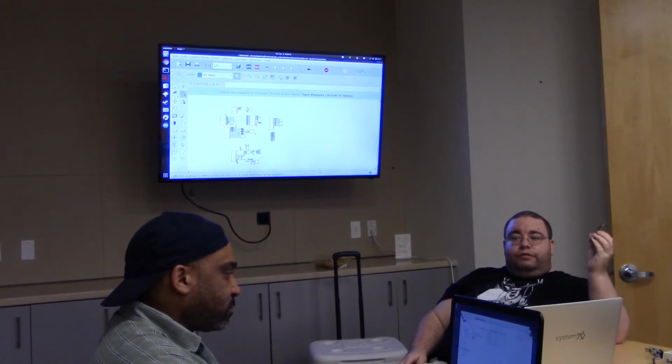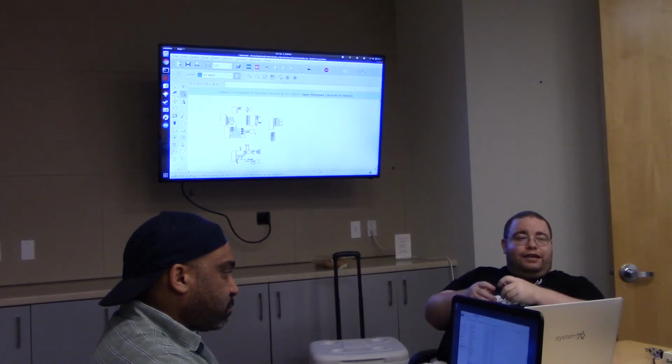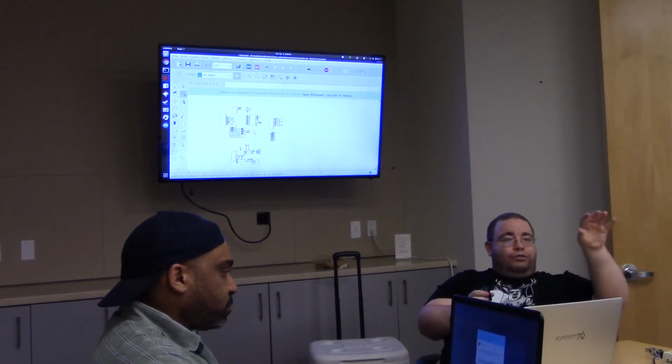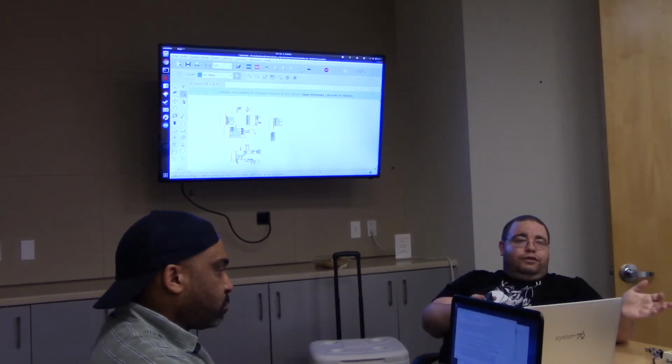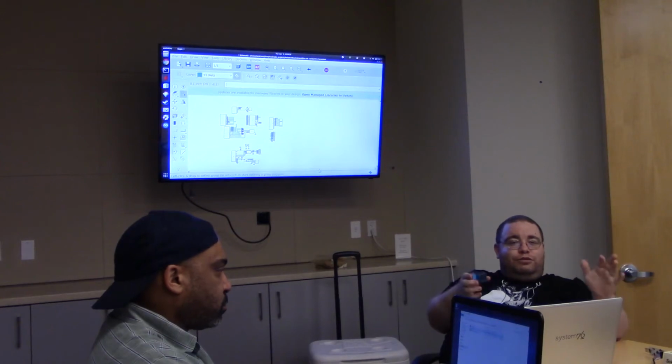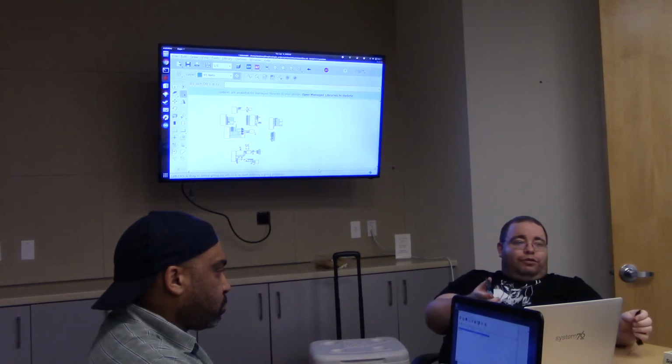I should start with, like I said, I'm not really planning this part of the presentation at all. This is just what I've been thinking about the past couple of days. The ideal world for me would be I can asynchronously write commands to this thing to set a target pointer in that chip, and then write a byte and increment that pointer. I can also set a data register and a status register to set what mode I'm displaying, anywhere between 320 by 240 at 8-bit colors to 640 by 480 at 8-bit colors, to have multiple buffers and change which one I'm showing at any given time, or have different text modes, and change fonts and things. I want to go nuts with it.